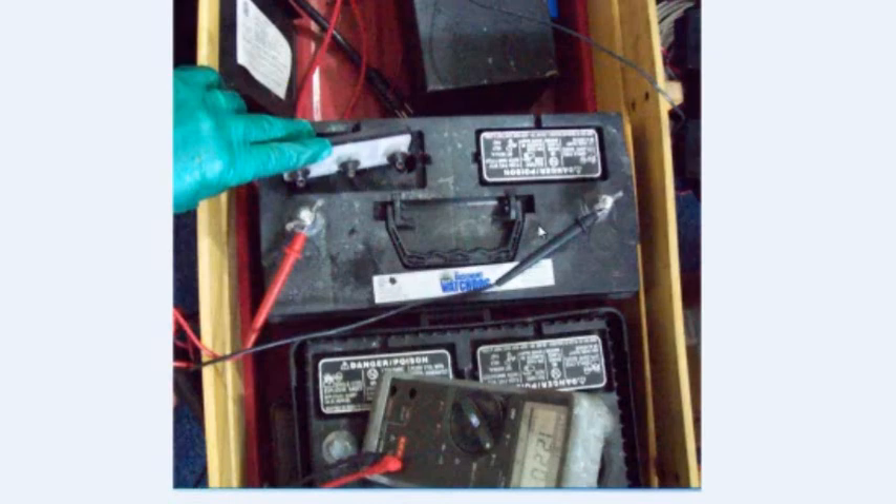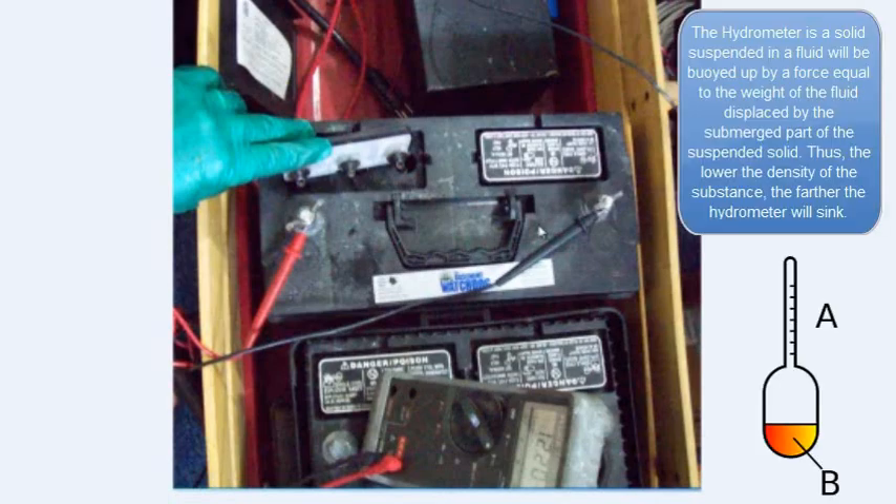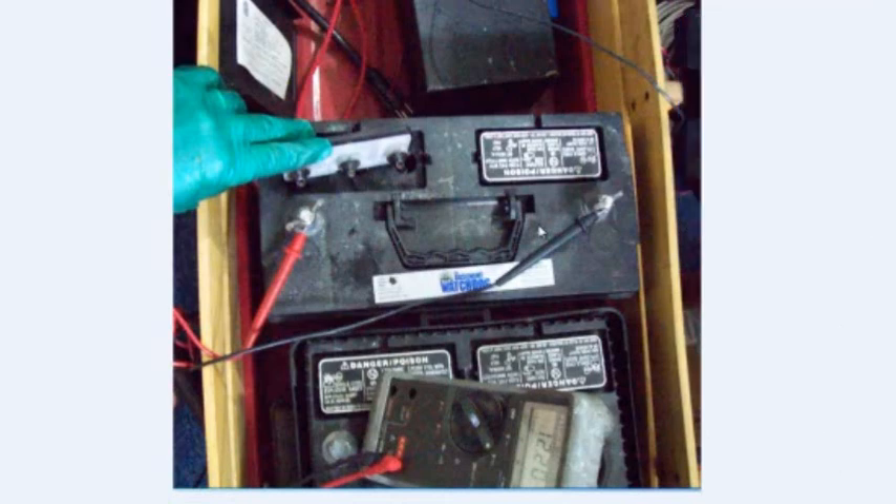It cannot be measured in a closed circuit, meaning there are loads hooked up to it. The next step some people use to measure the state of charge of a battery is a hydrometer. It will only work for a select few nickel-cadmium batteries but predominantly these flooded lead acid batteries.